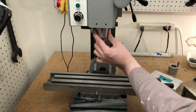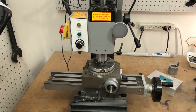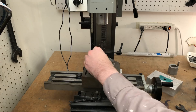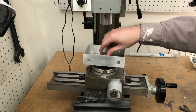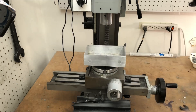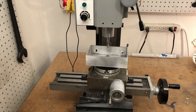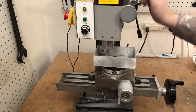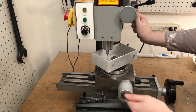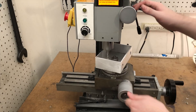I then mount a rotary table. A simple trick I learned for mounting a rotary table is to mount a taper in the mill and lower it into the matching taper of the rotary table, assuming it has one. This method isn't perfect, but for applications like this it's well within tolerance. I then use the half inch threads on the other side of my taper to attach the body using the hole I just made. By offsetting the x-axis and spinning the rotary table, I can now make a perfect hole of any size.